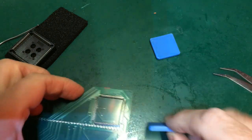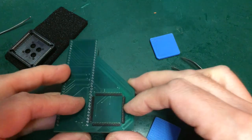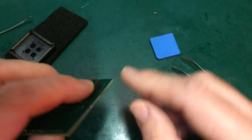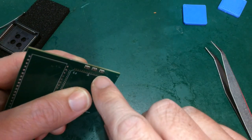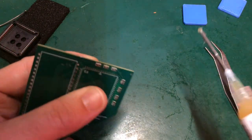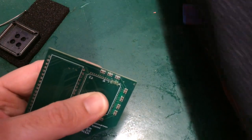So you see, what I'm trying to do, because my theory is that this row is leaning in too much, this one looks relatively... actually, they're both leaning in. So I think let's try plan B for these second two. What I'll do is I'll just try and hold it as tight to square as possible and solder a pin that I'm not touching. Let's try that trick. So I'm touching half of it, and I'm going to bob into this area up here, the half away from my particularly heat sensitive fingertip.